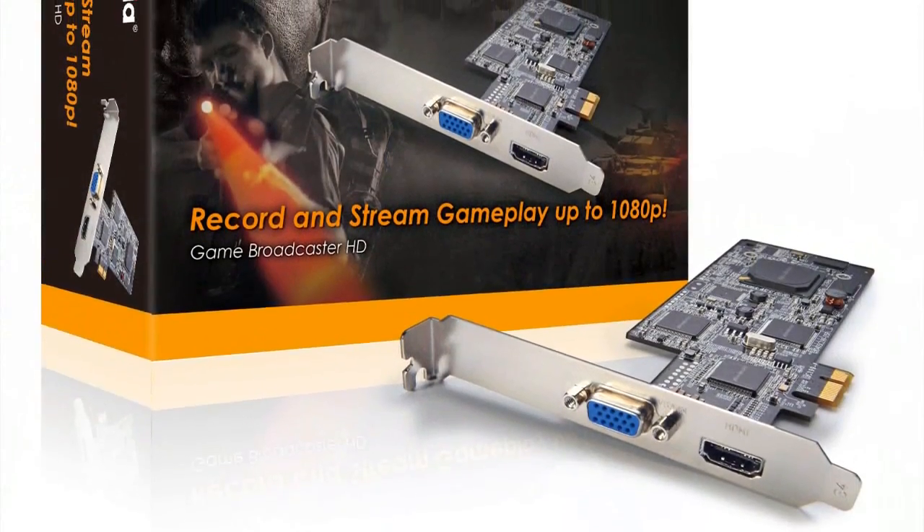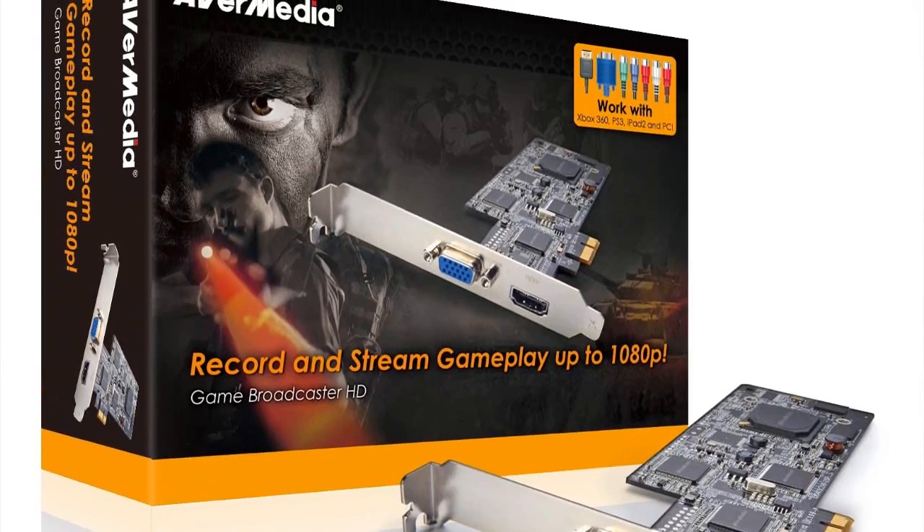The Game Broadcaster HD does have a few problems. Number one, I think they're missing an important accessory: an HDMI splitter. The capture card doesn't include a lag-free pass-through or any pass-through at all. If you plug your system into this capture card, that's the end of it — you can full-screen the capture preview, but it has really bad input lag and is unacceptable for gaming. For my personal situation, I needed an HDMI splitter to split the signal: one HDMI cord into the splitter, another into my monitor, and the other end into the capture card, so I could play with no input lag and capture at the same time.